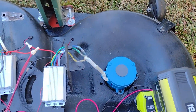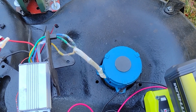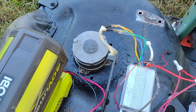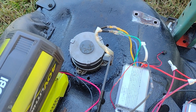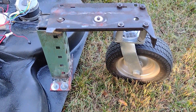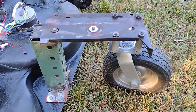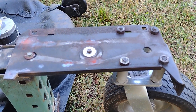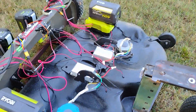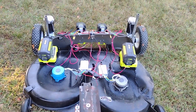The system is turned on right now. You can see that one motor is painted blue — that's because I'm testing epoxy encapsulation, and that'll be a topic for a separate video. We're going to see which motor lasts longer to find out if that's worthwhile. The other is a motor I had sitting aside. We've also got the bracketing back here set up better. I had a little trouble with the tech screws used to hold it down snagging, so we put bolts in with smooth allen heads on the bottom, and we increased the height back there for the tail wheel. Widening the stance and shortening the mower front-to-back seems to make it much easier to control, especially on hills.